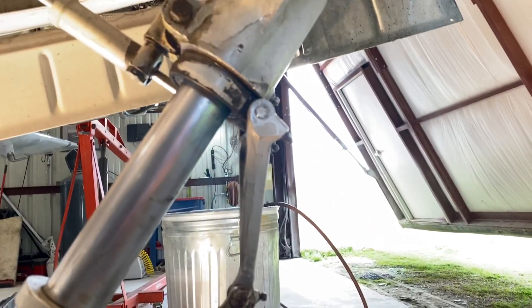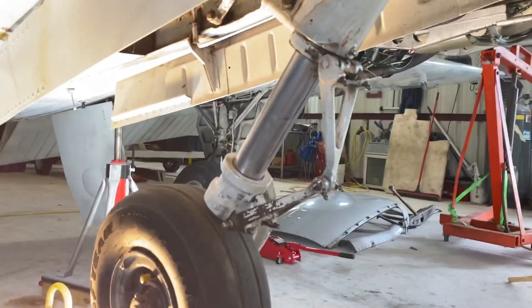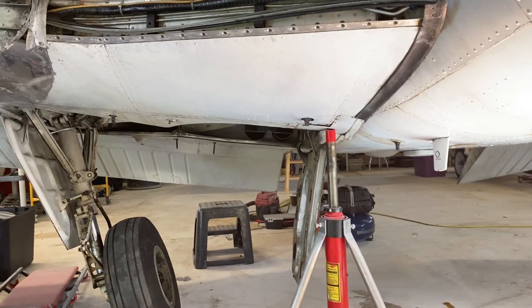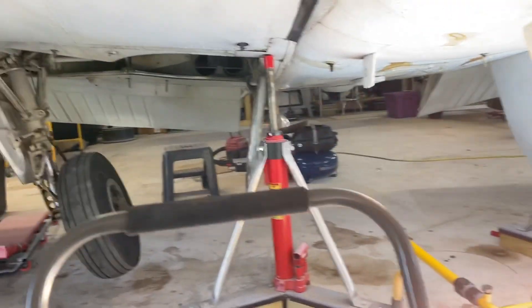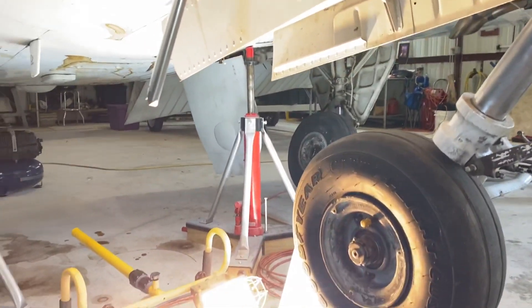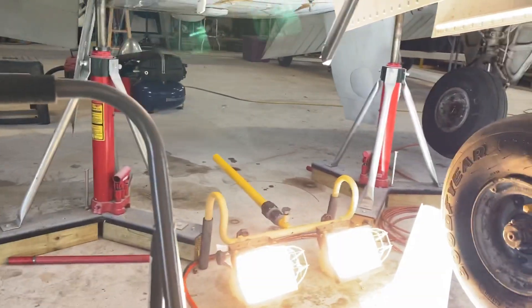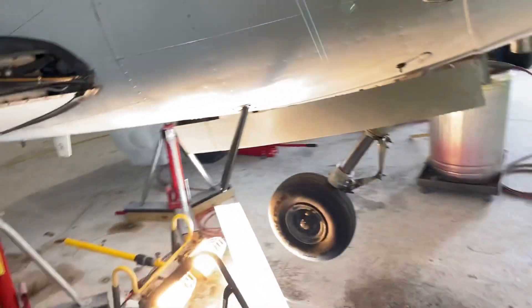Back in the day it was 80 octane. Works great for cleaning parts, but there's only 100LL available now, and it works fine — just a little more expensive. I go over to the tank, go into the drain, and fill up the cup. I've probably sucked a couple gallons out of this thing so far, dripped it into a bucket, and been washing parts and greasy stuff. Getting her all scrubbed up and cleaned up so I can inspect everything real close, then grease it, and go from there.